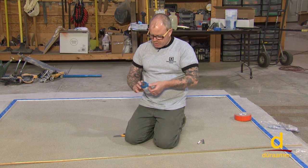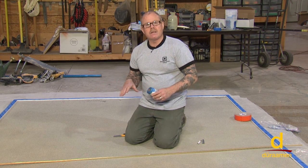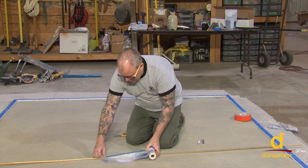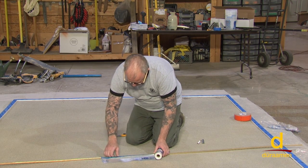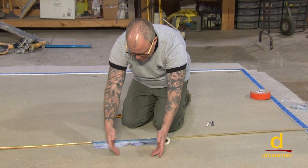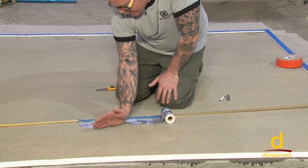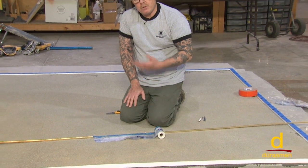If you're not polishing it, there's no way you could pour a whole floor monolithically. You would have to do sections. So what I'll do oftentimes, once our divider strip is attached to the floor, is use this masking plastic and carefully mask right to the top of the divider strip, and then fold this plastic out. When I pour my overlay cement, I know that I'll be able to smooth or trowel right up over the edge and bring a wave of material back over this, so I know that I'm in fact level. But here's the important pointer that a lot of people are not aware of.